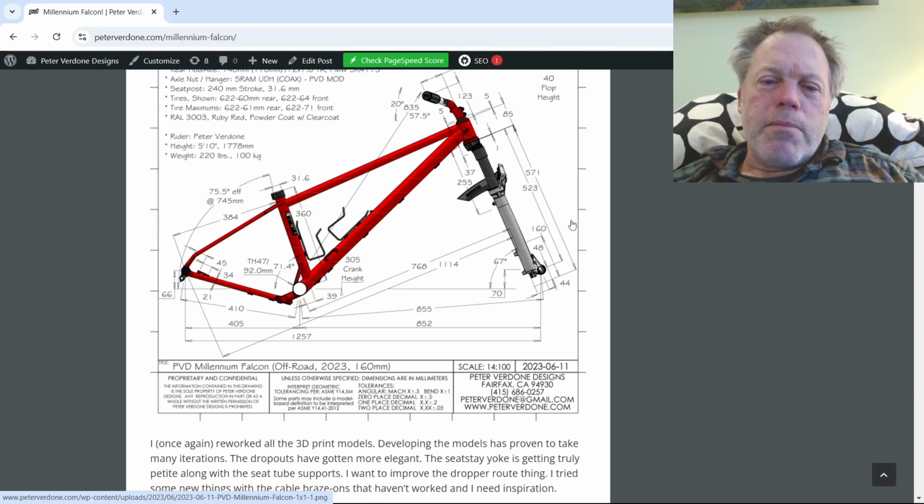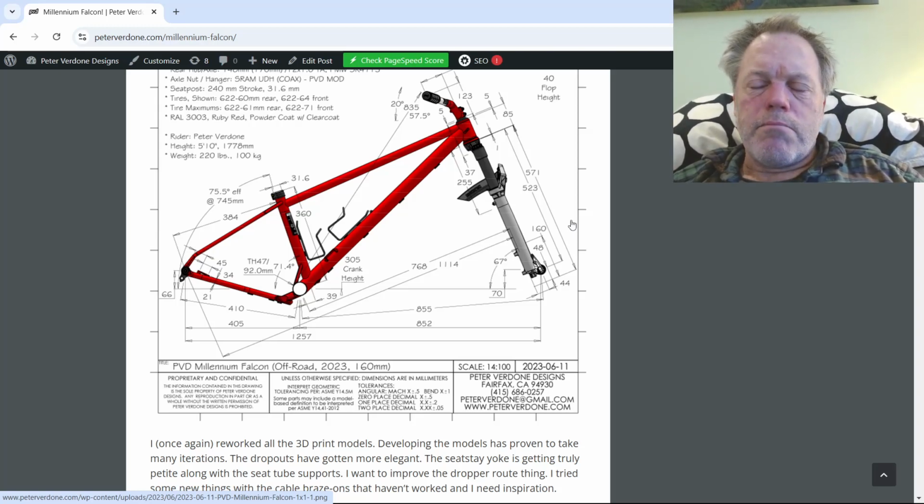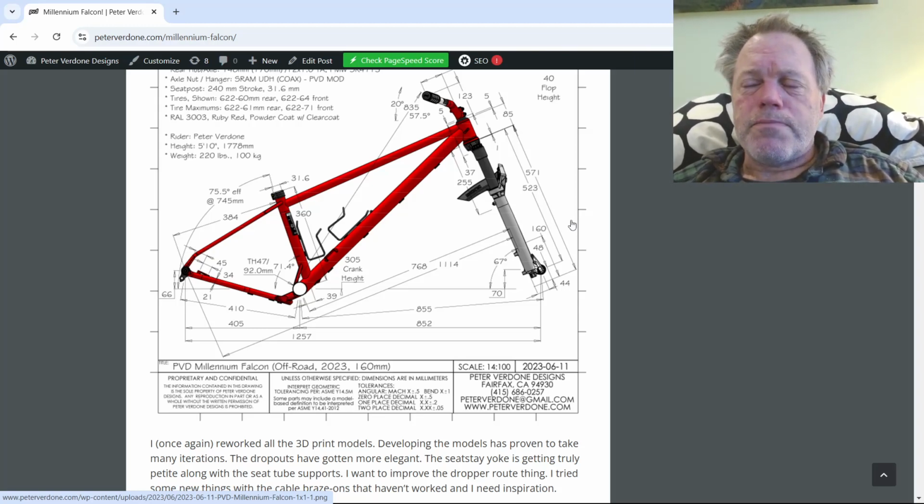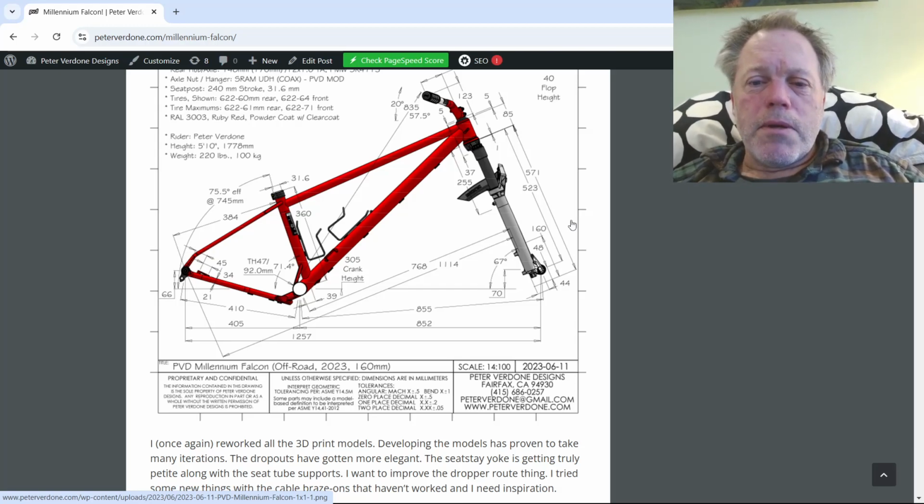And this is a trickier bike because it's a bigger hit bike, and bigger hit bikes tend to go down steep chutes, and in that type of environment, the head angle could affect how the suspension works at that critical moment. But of course, the head angle affects how the suspension works throughout the rest of the ride, and that's where we're getting the huge gains from the steeper head angles. And that's probably to the detriment of suspension action in a steep descent. But is that truly noticeable in the environments that I'm playing in?